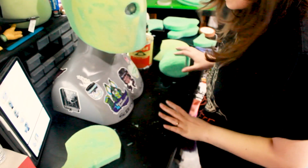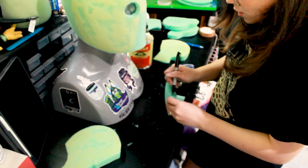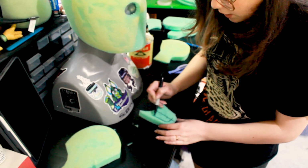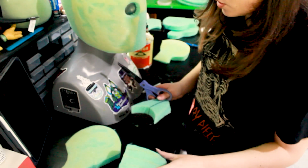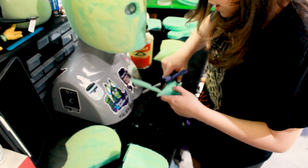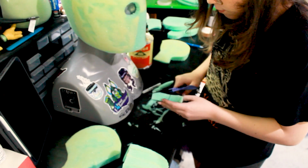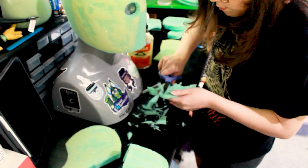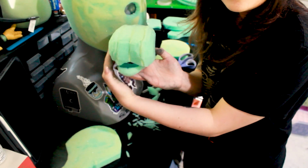I think while I'm here, I'm also going to carve the lower jaw. So we'll take a marker, mark out the center. What we want to do is make sure that there's a lip. So we're going to end up carving out this middle part. So all of that gone. Goodbye. And we're gonna round out the bottom edge like we did with the muzzle, making sure there's no straight lines except for the line that is going to eventually be glued down to the bucket. So now we've got the upper jaw and the lower jaw.